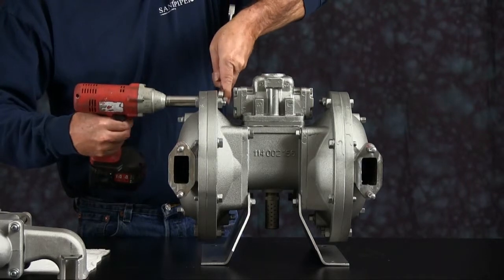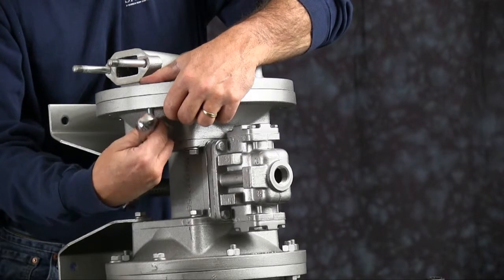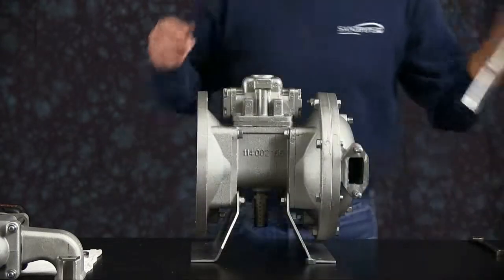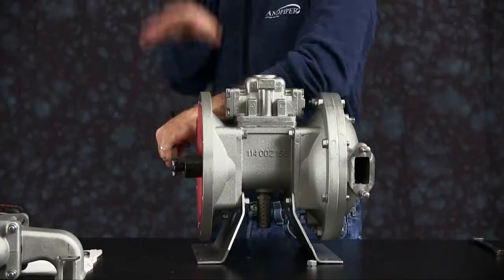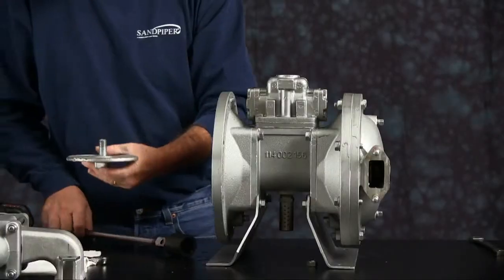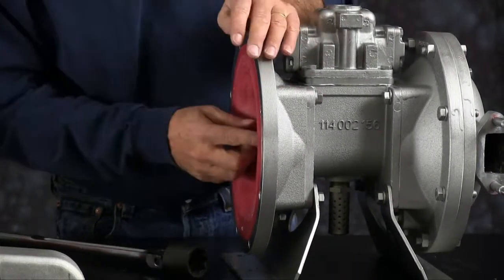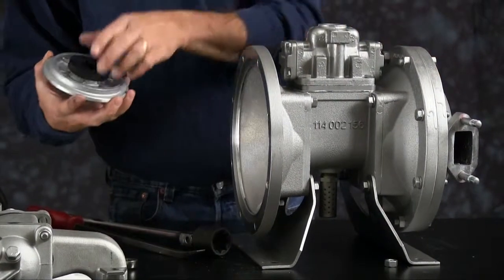Take the gaskets off. We'll take the outer chamber off on one side. You're going to have two blind holes — you'll want to leave those for last; it'll hold the chamber in place. Turn the unit up on its side, take the chamber off, and set it aside. Loosen the outer plate from the diaphragm rod. On an older unit it may take some time; it may be a little stuck but work with it. Pull the plate out. The diaphragm sits in a bead and you may have to reach in and pry it out, especially with thermal plastics. Take the inner plate, set the bumper and the inner plate aside.